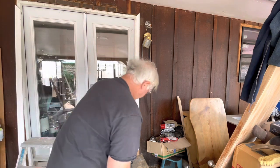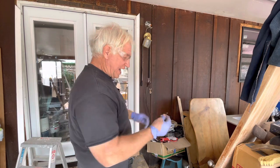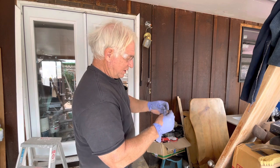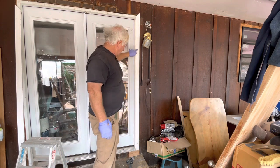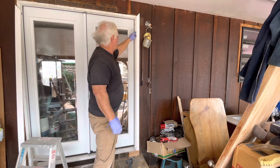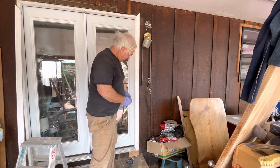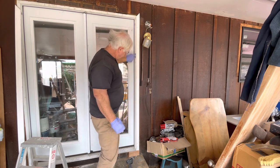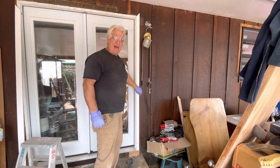Okay, so the best thing to drive this with is these semi-finished hex screws. Probably you need about 2.5 inch. These are 2 inch. And you can drive them in and they leave very little evidence of where you fasten. I've just temporarily put this on to give you an idea of how that looks. Super clean, you caulk the back side.